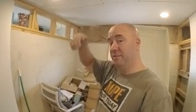And if I haven't already posted this in a previous video, at the time of this filming, I've got a lot of footage that I need to go through, and I'm not sure if I actually talked about this on camera or if I've posted the video. I think I posted the video when I was doing the drywall on the ceiling in here. But what I ended up deciding to do is we're just going to put drywall all the way across these walls here. And so all along the bottom here, I got some shorter, like 1¾ masonry screws. So I'll have to pre-drill it. Once I attach it at the top with the timber frame support, that'll just hang down and I'll have everything in place, and I could just come through with the rotary or the hammer drill and pre-drill all my holes and drive in the masonry screws.